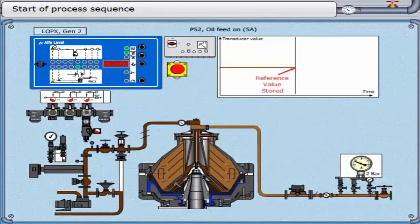A back pressure is established in the clean oil outlet. The minimum value of this back pressure will be dependent upon the delivery height, which is usually quite low for lube oil systems. The operating back pressure is set by the regulating valve, midway between the delivery height pressure and the pressure required to overflow the bowl. The transducer reference is stored by the EPC 400 at the end of this timer, which runs for 120 seconds.